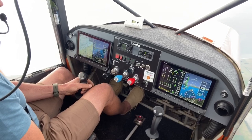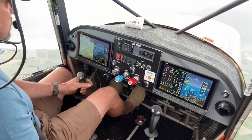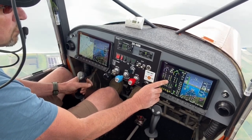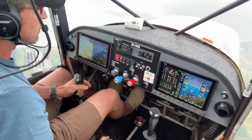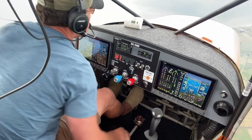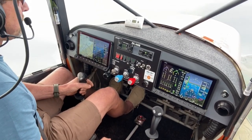One point of interest is that just before the engine stopped each time it surged, there was a decrease in fuel flow pressure that I was able to observe by looking at the panel. That's not much good when I'm flying along because I may not be looking at that instrument specifically. What I've found is that each time the fuel pressure dropped below 20 psi, it was accompanied by an engine surge or a complete stop. So I've now lowered the red line to 20 psi — I'm actually pointing to that in this clip here, watching the fuel pressure decrease, then the fuel flow starts to decrease, and then the engine stops. I've set the red line to 20 psi, which now gives me a warning of about 8 to 10 seconds, and you can quickly reach down and change tanks if you're quick about it.